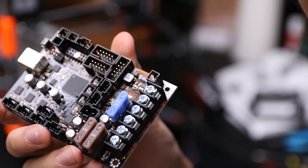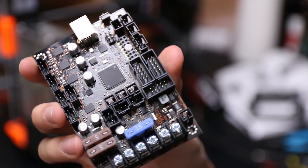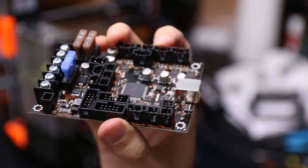One other criticism I have for this printer at roughly $800 is that it has just this tiny little LCD screen like any other cheaper printer, which is not that nice. Even some quite inexpensive Chinese printers nowadays have colorful touchscreen LCDs with nice menus, which on this printer I would almost expect. I know it's because they're using an 8-bit board, and what they're doing with that 8-bit board is really impressive — it is completely jam-packed full of stuff and works way better than most 32-bit boards. But for a Mark IV, I would hope they move to 32-bit so they can add things like a colored LCD touchscreen, which would make the whole experience a little bit nicer.